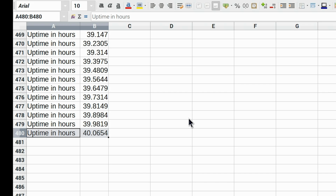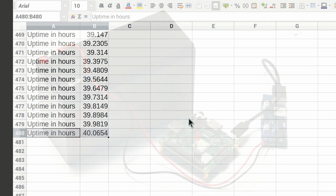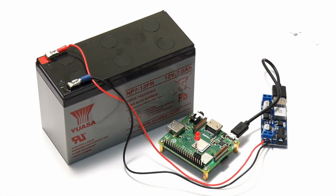And I guess we know from the power bank test that the Raspberry Pi 4 is using less current in my test here than in the Raspberry Pi Foundation's bareboard notional figure. And it has to be the case that our lead-acid battery has got a significantly greater usable capacity than 65% running on a low current drain as we've got in this test. But even so, this is a spectacular result. Anyway, I think I'm now going to move on to test out the Raspberry Pi 3A+ on the lead-acid battery, and I'll come back to you in a few days, during which time I'm sure I'll be musing on the Raspberry Pi 4 result.